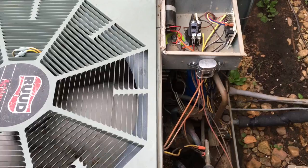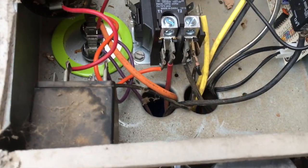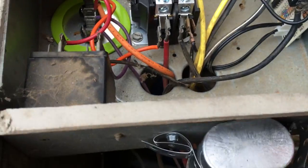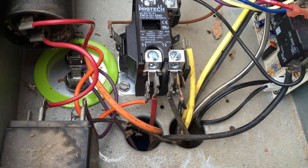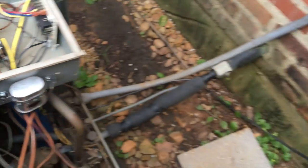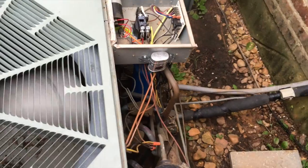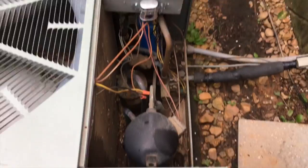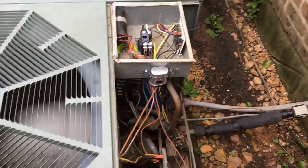Okay, well now that we have the common wire hooked to the compressor — we forgot to hook the common coming from the compressor on the contactor. See, anybody can make a mistake. Now that we've done that, let's try this again. That's better — it'll work better that way. All right, she's off and running.